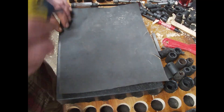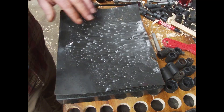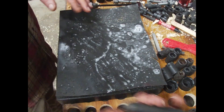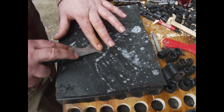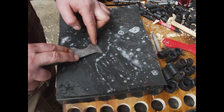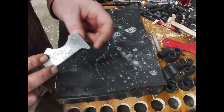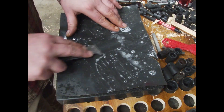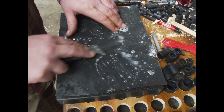All you do is spray it all down to get the paper to stick to the surface plate. After that, you want to hold your blade at a decent angle, barely touching the edge, because you're going to hone that edge off and make it extremely sharp. All you do is keep that perfect angle while moving the scraper.